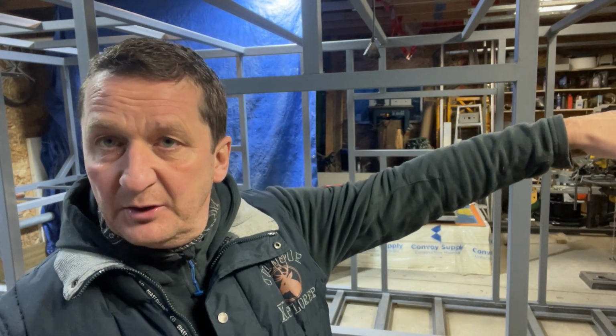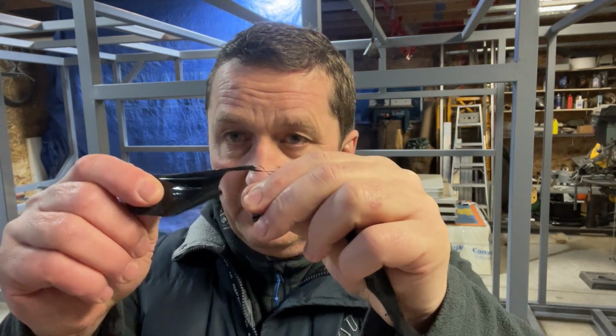I did a test paint on the bare metal here, without sanding or priming or doing anything. I just cleaned the oil off and painted it. And that wasn't good, because when I took an Olfa knife and scraped it off, it came off like this, like plastic. Of course, that's what this stuff is for, right? It glazes the object and prevents oxygen from getting to it. And it came off the steel, no problem.